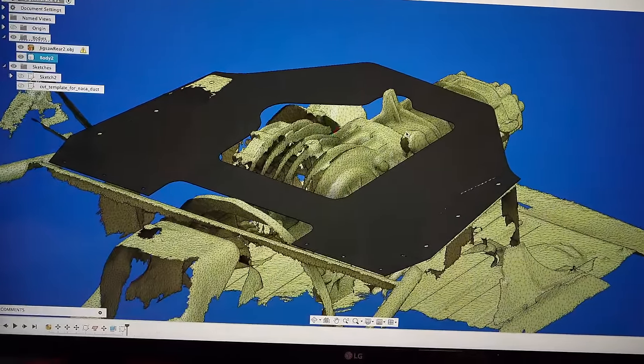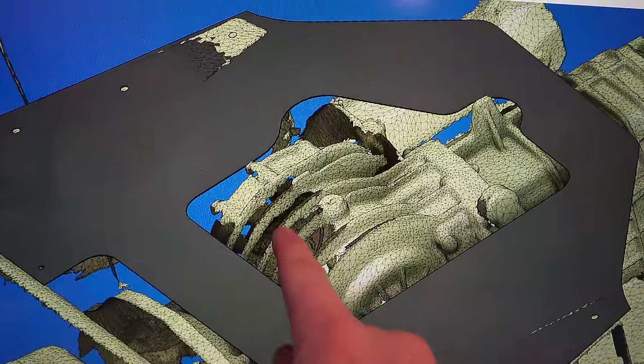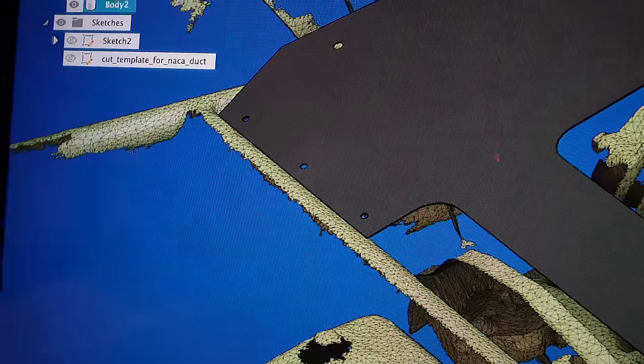Here's what I've come up with so far. You can see how nice it is to be able to 3D scan and model in a 3D plane and mock up around these parts — like at the bottom of the diff where it protrudes, and the edge of the bar where I can add holes and have the plate made up exactly where I want. It just saves a lot of time. It's 2024 — this technology is relatively affordable. This scanner is less than $1,000, Fusion 360 is free for home use, and you can get a 3D printer for less than a couple hundred bucks for mock-up. A CNC plasma table is more expensive, but even just designing in 3D space will increase your productivity and quality. This is not an ad — I just really like this workflow.